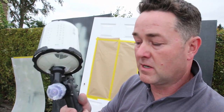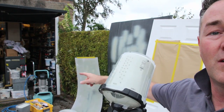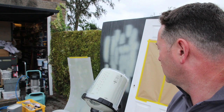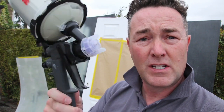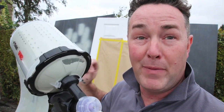I've got my 24 litre Gretling compressor from Sprayman UK - about 600-700 pounds, brilliant compressor. I'm hoping that's enough power to actually run this gun because there's been some question mark over whether there's enough airflow for this gun. I've had a bit of a practice, I can get paint through it, which is a good thing. I'm using a 1.6 air cap, HVLP 1.6.